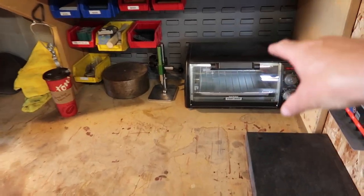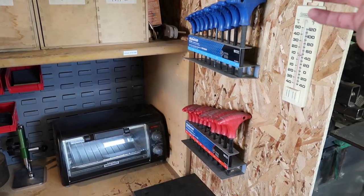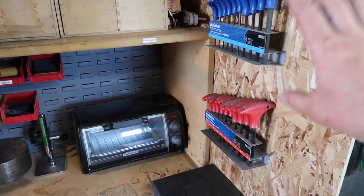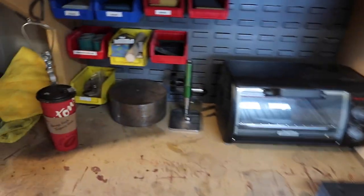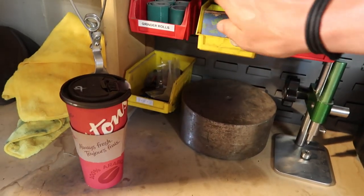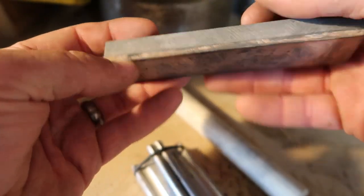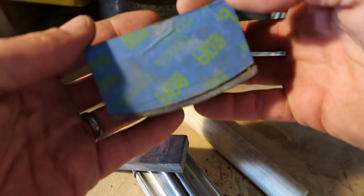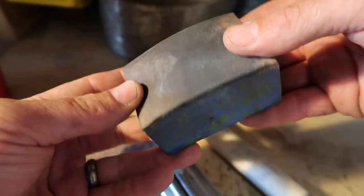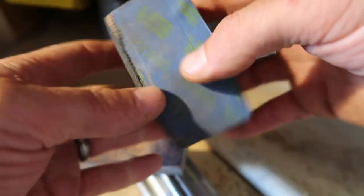This is also my main knife making bench. I moved my oven from up here down there to make room. I actually use Allen keys a lot for different screw-on handles and adjusting things, so those are worth being out. I've got all my different sandpaper assortments — I need a few more, some are unlabeled, this is 2000 grit — and different sanding blocks. This handy one is just a piece of 3/8 G10 with leather glued onto it. With my 10-inch contact wheel, I cut a 10-inch radius on solid maple and used Super 77 adhesive to spray on some leather, so when I'm hand polishing my hollow grinds I can use this little block — works really well.